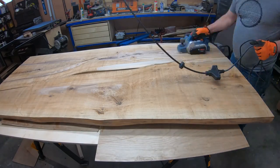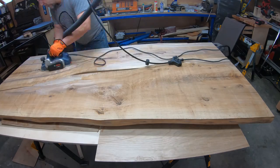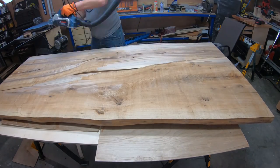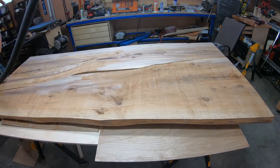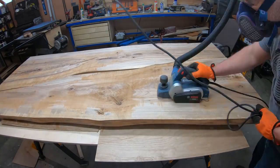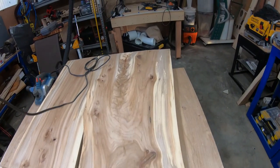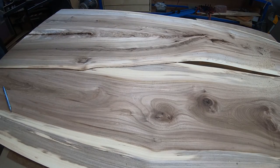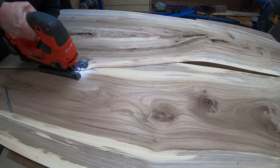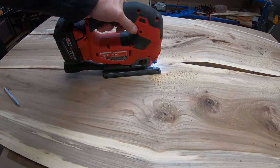I decided before I joined these things together, I'd better just plane them down pretty good. Without real access to a router sled — I had one from an older project but it just wasn't big enough — the hand planer did an excellent job of just taking this thing down. In typical fashion, I found nails deep inside that wood, and that planer blade was not happy. I also realized the slots were just a little off — I wanted the slot to be even down it, not wider at one spot. So I marked it the same distance, then angled the jigsaw and made that cut.